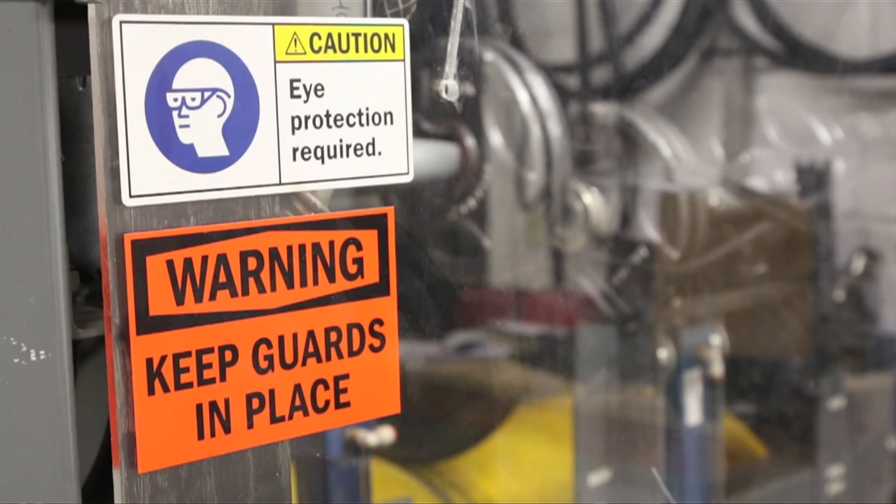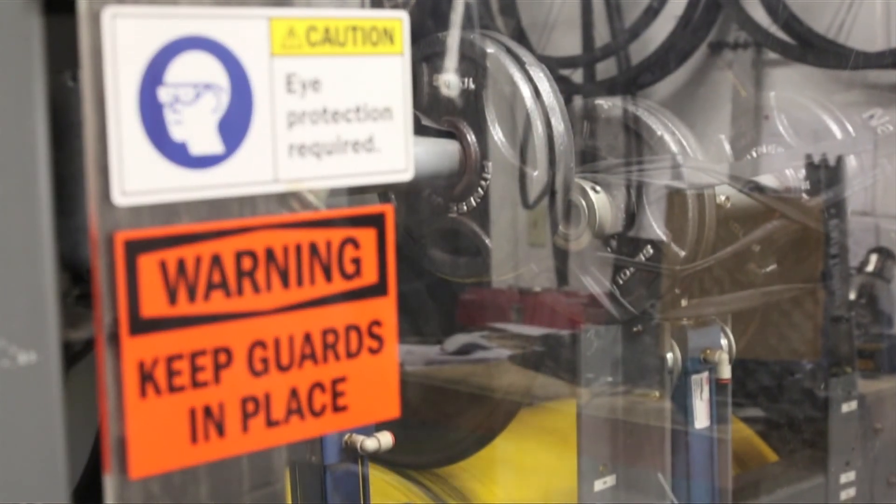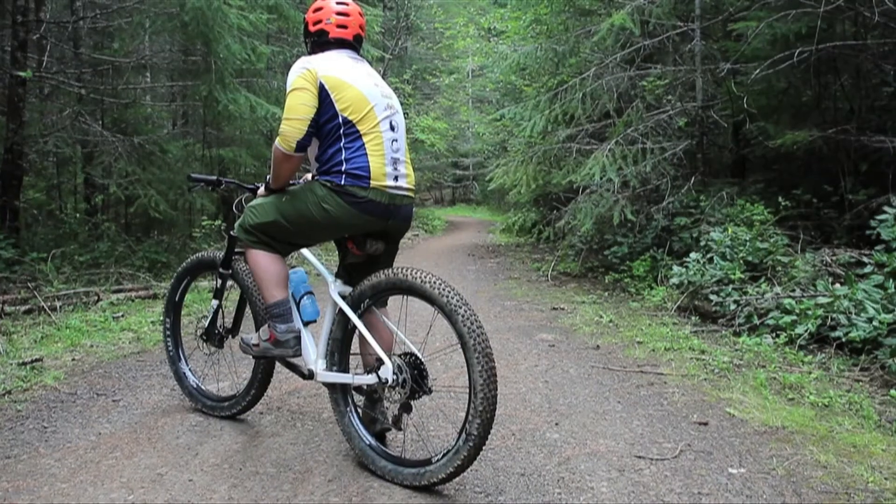The drum tester is an accelerated fatigue tester. We load each one of the wheels with 150 pounds at the axle, so the wheels are constantly getting hit by this bump, and we'll run a wheel on that for weeks. The idea is accelerated fatigue — we're trying to wear that wheel out in a rapid manner to simulate how it's going to wear out in the field.